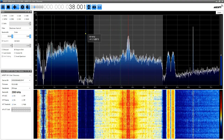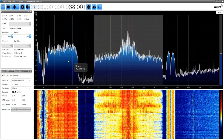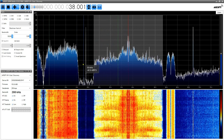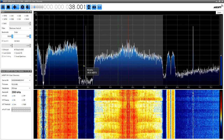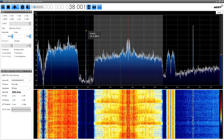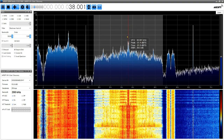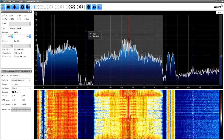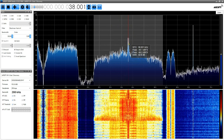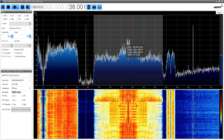So what is this 19 kilohertz carrier doing right here? Well, first off, we roll the audio off at 15 kilohertz so that you have an empty hole here in the spectrum. And they put in this 19 kilohertz carrier. Now, 19 times 2 is 38. And when you take this with the correct phase relationship and place it, this is a double sideband. It's not a single sideband receiver, but a double sideband receiver, right?